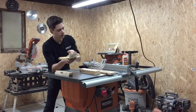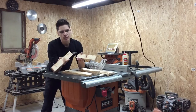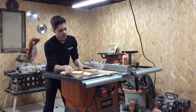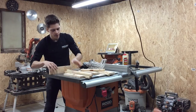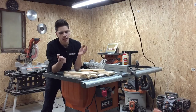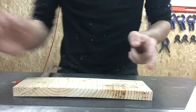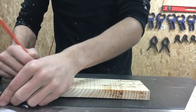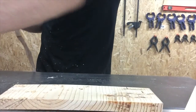Follow the cut diagram linked below — you can download a PDF of the cut sheet. We have three-quarter by three-quarter inch dowels for the side panels: five per side, ten total. We have top and bottom rails — two inches wide and three inches wide. To make each side assembly you have the bottom rail, all the spindles, and the top rail. First we need to make the arc on the bottom rails. Use string and a pencil to draw the arc — measure in two inches from each side, make a mark, and arc between them.